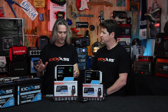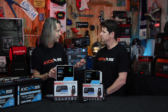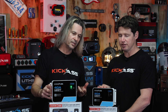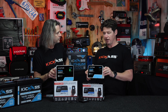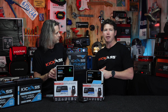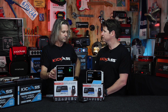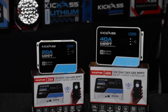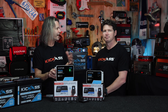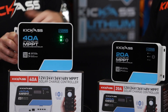Two units can also be joined together to increase your solar panel capacity. These have a data port, so you can take one 20-amp and another 20-amp, connect them together via the data port, and get a combined 40-amp output charge to your battery system. The same applies to the 40-amp MPPT controller — combine two together to charge in parallel at 80 amps. That's awesome for people starting out, like an off-grid fishing shack — put one on there, and if you need to upgrade later, just add another couple of panels and another controller. Bob's your uncle.